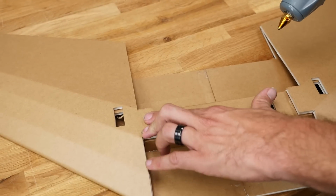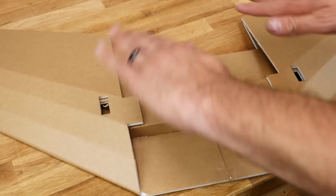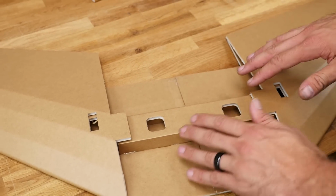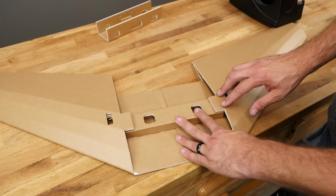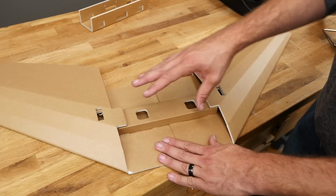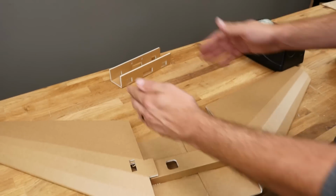Now these two little tabs here are really important. Under positive level pressure, you're fine. Everything's going to compress. But whenever your wing goes down, this area is a good spot, especially on the arrow, where it would crack. Because we have extra room here, we have the luxury of putting a center spar in here, and these little tabs are going to keep it from cracking this way.